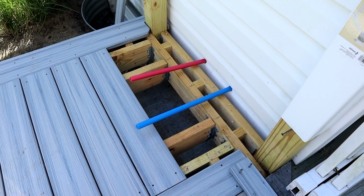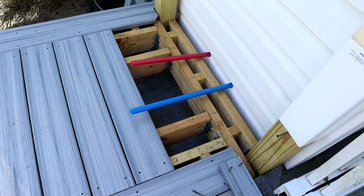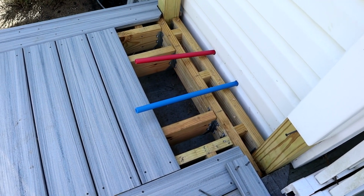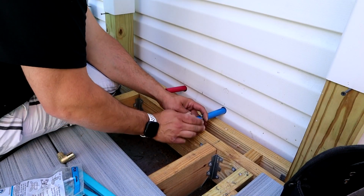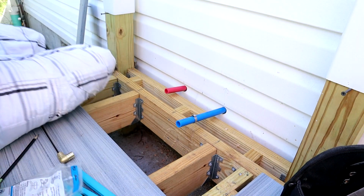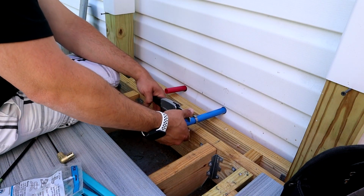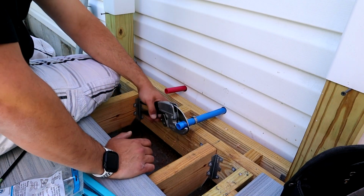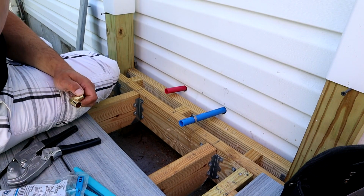So I'm going to keep these long. We'll do our valve connections, and then we'll push that whole thing into the wall, and then we can cut it to the length we need down in the basement. I'm going to start by putting these elbows onto the stub outs. I think that's a factory edge, so it's always good to cut that off. Start with a nice clean edge.